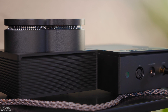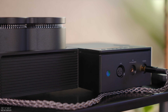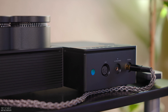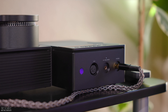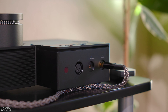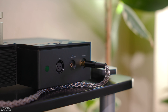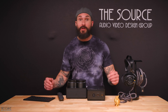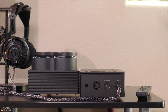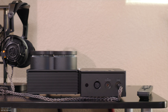According to Yamaha, the HAL7A uses four sets of power amplifier circuits on the plus and minus sides of the left and right channels of the output stage, which are floated from the ground, resulting in symmetrical push-pull orientation of the output stage. This allows the headphones to be driven without altering the amp's configuration between balanced and unbalanced, which helps minimize sound quality discrepancies between the output terminals. The power output is the same on all three headphone outputs — whether you are listening to the 4-pin XLR output, the 4.4 Balanced Pentacon, or the single quarter-inch headphone output.